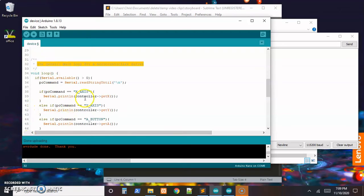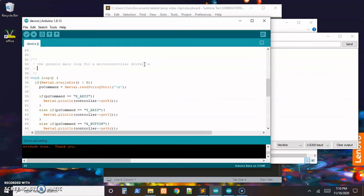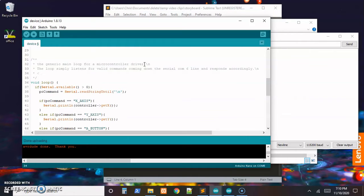Go ahead and update the documentation to list out what the valid commands are. So here in our Doxygen comment, the loop itself, we'll put a new line, and in the description, the loop simply listens for valid commands coming down the serial COM6 line and responds accordingly. Then I guess I'll put in a header tag to make that stand out. In a header, then I'll put valid commands and make a list of these.